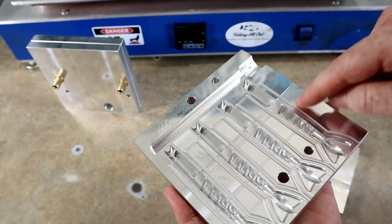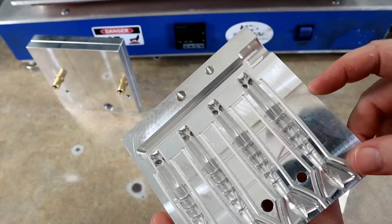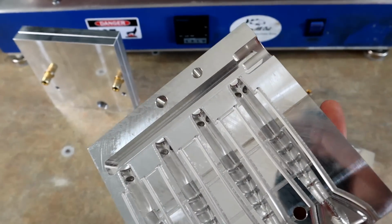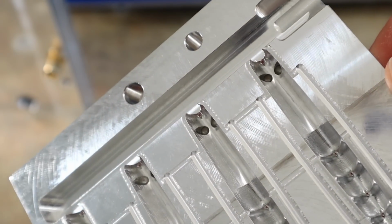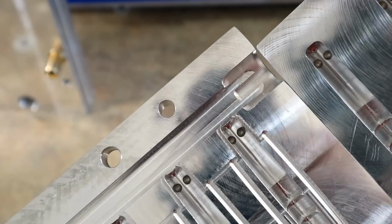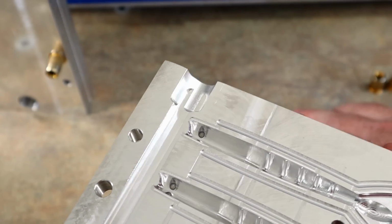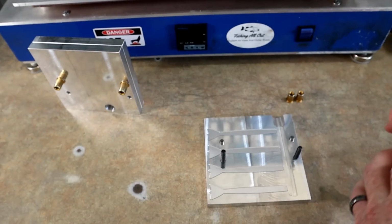So we're also going to shoot this mold today, but just to show y'all what was going on, they were just having air get trapped right up there in those really deep eye sockets. One of the main features of a shrimp are those big eyes that they have, and he really wanted to keep that feature just like the open pour version. But that's a nightmare for injection. Just take it from Josh and Gary going through all the test molds here. That proved to be difficult.